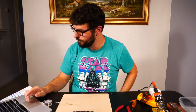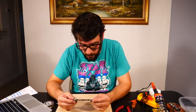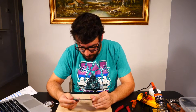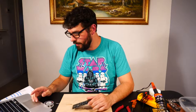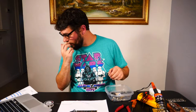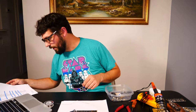Are we done yet? No, we're just getting started. Let's do it — low voltage power components. Moving on to the main circuit board. Start by installing diode 1 through diode 3. I've also printed out the table of electronics components so I can reference what they are.